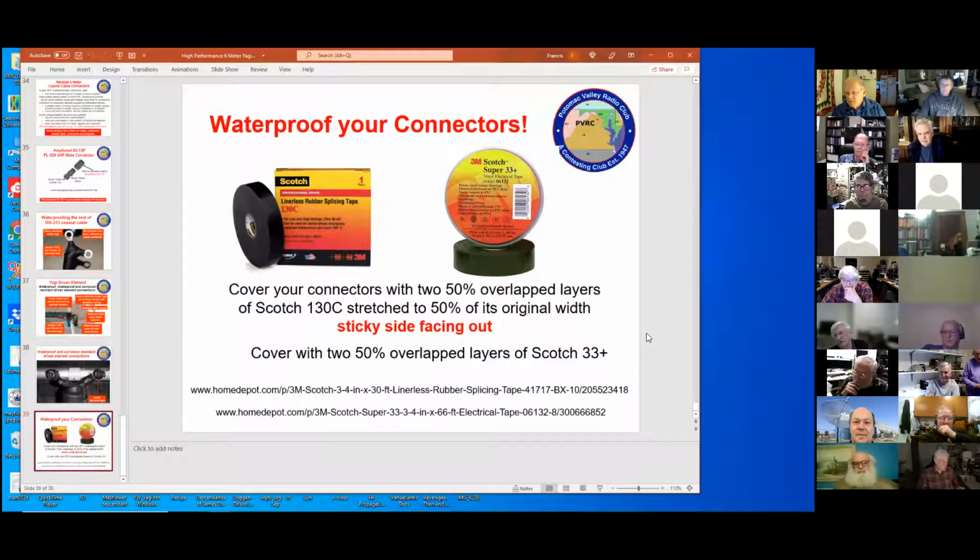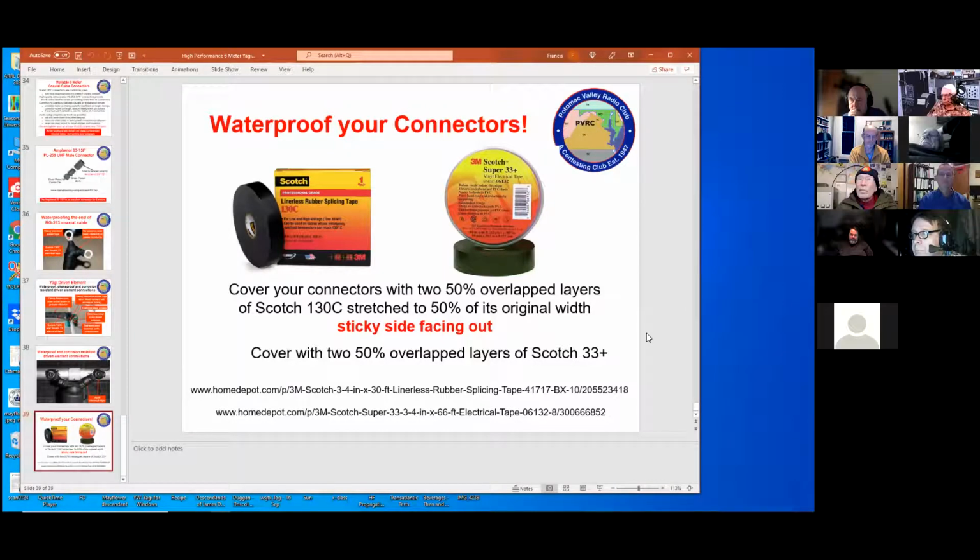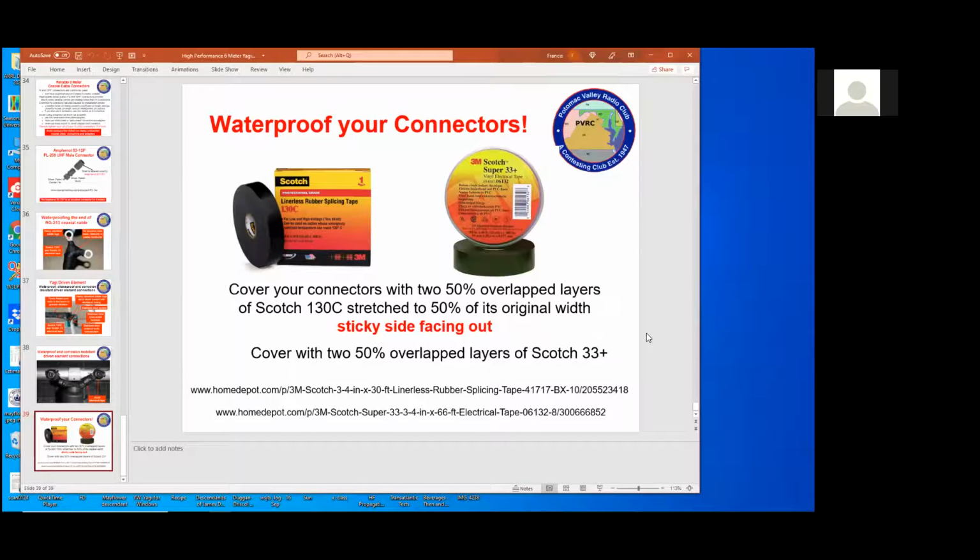I certainly wouldn't recommend that you raise it 2 or 3 more feet. So I would leave the one in place that you've got and take a look at Lionel's chart and mount the other antenna at roughly the spacing that Lionel recommends. You don't have to be exactly that dimension. And he shows 2 figures for spacings. One is the 100% optimum spacing. That gives you the maximum possible gain from the stack. So I would recommend that you use that number rather than the 75% number that he also shows, which gives you a little bit less gain. Okay, thank you.